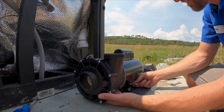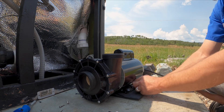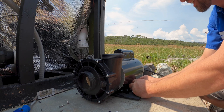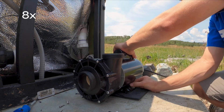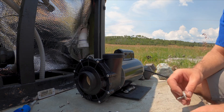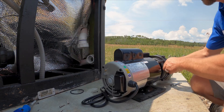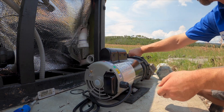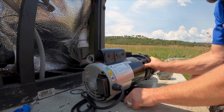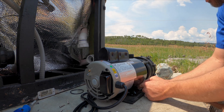Got our new pump. I'm just going to bolt it back on — do everything backwards from what we just did. I don't like to tighten down these bolts right off the get-go; I wait until I have all four at least threaded in there so that I can move the motor around while I'm trying to mount it up. Makes it a little easier.